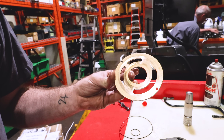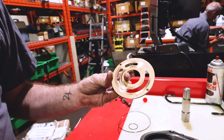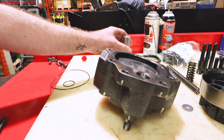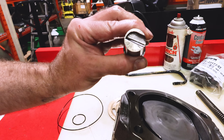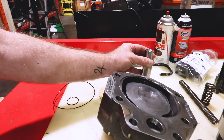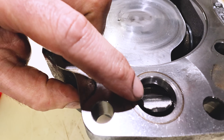Either you have a leak in your suction line that'll cause aeration, or cavitation is just struggling to pull oil. Pumps don't want to pull oil — they only want to push it. As far as this is concerned, you can see it's got a huge groove in it, but it's not even centered. That has caused just a minor bit of wear. We can probably repair that without too much trouble.